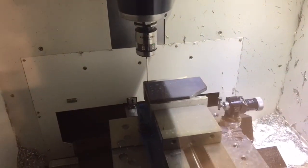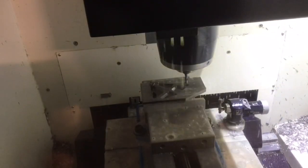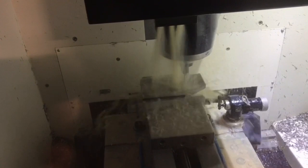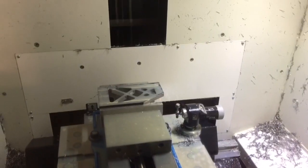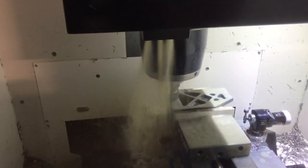I mentioned earlier how you can do this on a drill press — and it would be a perfectly acceptable part. To do it on a drill press, all you have to do is find the center distance of the two holes that run the screws through to bolt this up to the lathe and go drill them on the drill press. Then you could take the piece of stock, put it on the lathe itself, and drill the hole in the center using the lathe chuck. That would be a perfectly fine way of doing this piece — it would work, it would be functional, but it's not necessarily going to be the most attractive looking part.